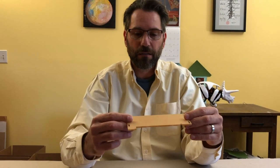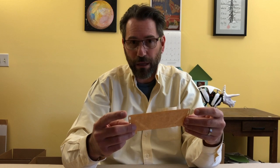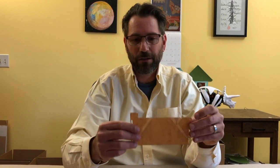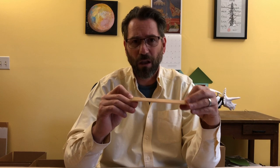I assume you have downloaded the DXF files and cut them on your favorite laser cutter. The whole design is made to be cut out of three millimeter acrylic, also often called one-eighth inch acrylic. The distinction is sort of non-specific, so you really want to put a pair of calipers on your plastic and see how thick it is — it varies by manufacturer quite a bit. You want something as close to three millimeters as possible, because the width of these little holes I have measured to be three millimeters.